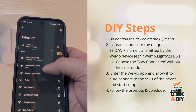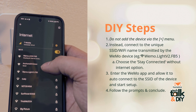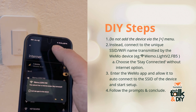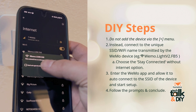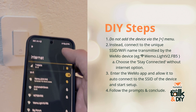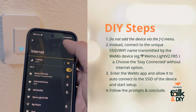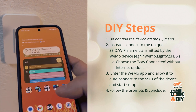We're trying to connect to it right now. On Android — and I believe iPhone as well — it's going to say it's connected but no internet access, tap for options. You want to make sure you choose yes, stay connected. Now it's connected but not giving you any internet — you'll see the little exclamation point on the Wi-Fi icon. You're on this network now but not getting internet, which is fine.